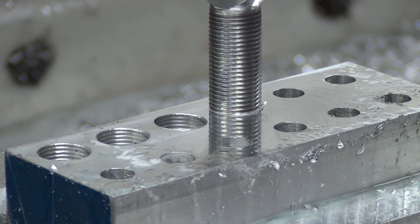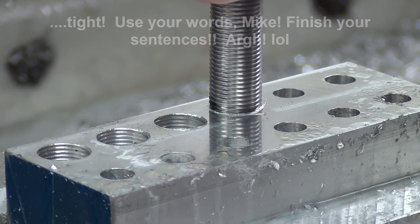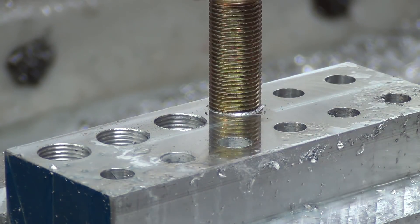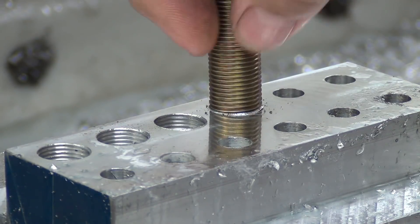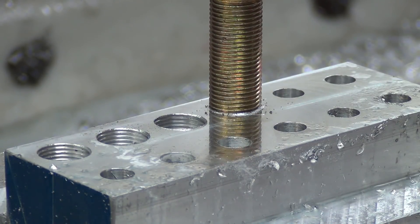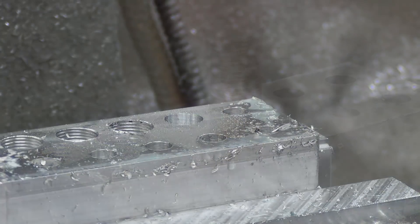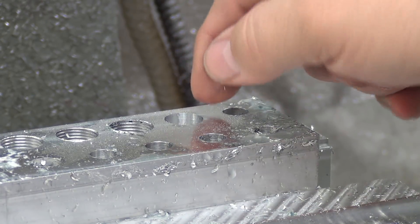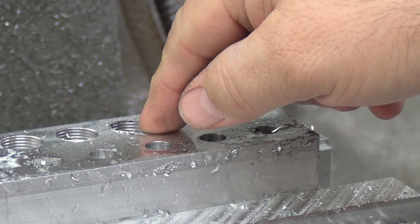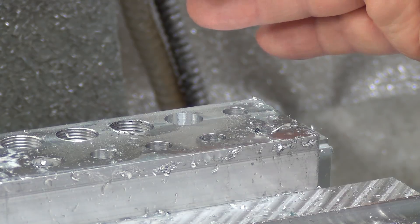What the hell — it goes from seeming like it's going to be too loose... that's definitely too loose. So I told it to repeat that finish pass in case there was any taper in the wall, since that's what it seemed like going in. But I've since found that I had my thread pitch at 0.049 instead of what it should be, which is 1 divided by the thread pitch 18, which comes out to 0.05555-something.